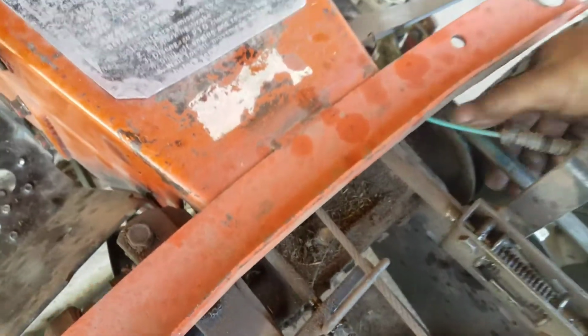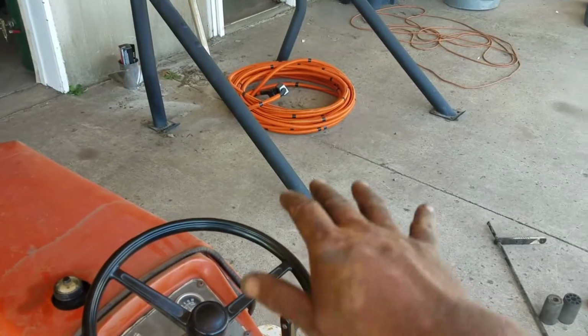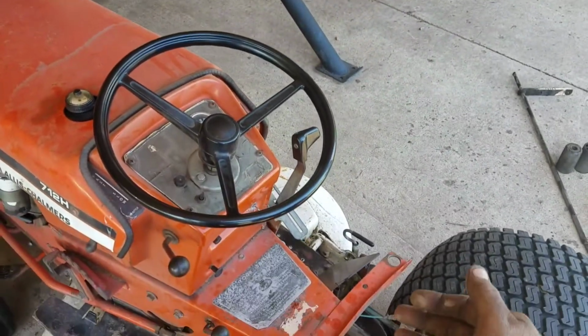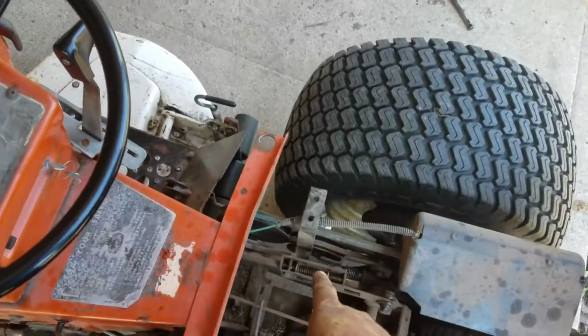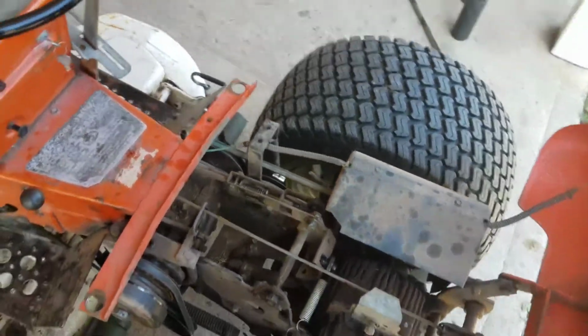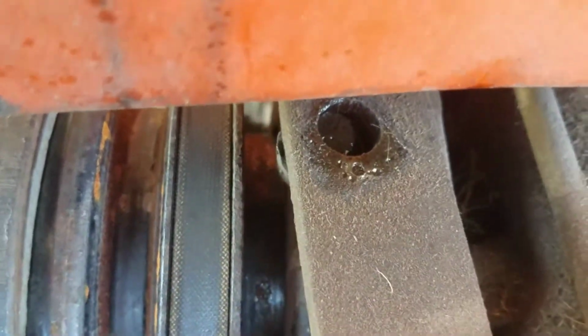This beveled gearbox has so much side-to-side play in here, which, of course, I can't show on demand. That shaft is moving back and forth, so when I'm on a hill and it's tilted to the side, it's actually making noise. I also have to replace the idler pulley in here, different things like that. And I'm debating if I want to replace this clutch assembly because that thing is not in too good a shape.